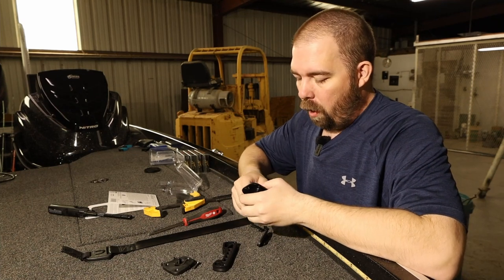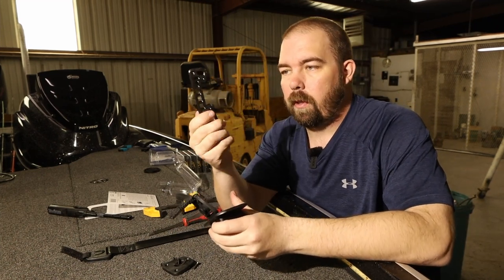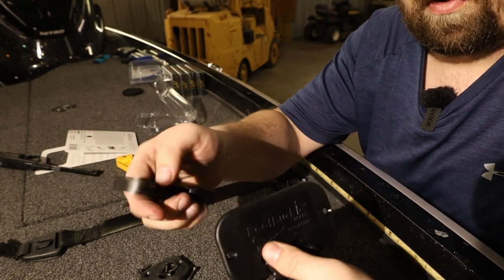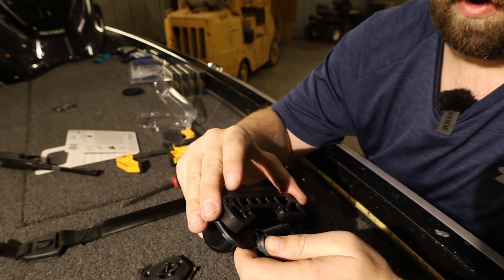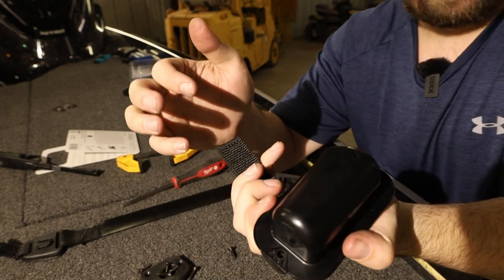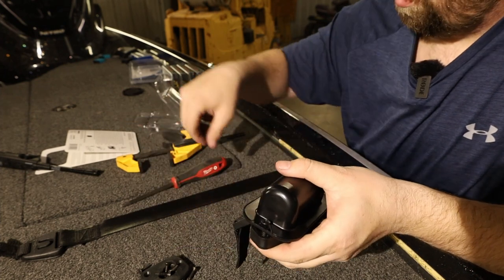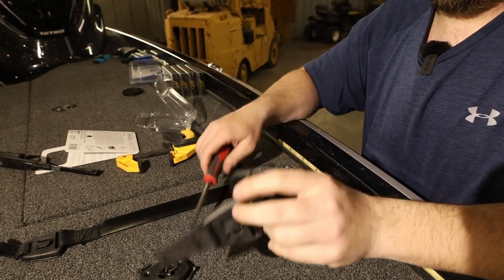While I'm over here playing with the rod buckle, let's go ahead and get it ready for mounting before I start drilling all my holes — it's just going to make it a little easier to deal with. First we're going to deal with the mounting clip, which is just to give it more sturdiness and actually something to mount to from underneath. This little mounting frame only goes on one way because the boat buckle itself is offset, so we need to put the boat buckle on correctly where the strap obviously goes in between these two easily. Then on the back side we're going to put a screw in and go ahead and start screwing that in — not all the way tight because we got to get the other side in as well.